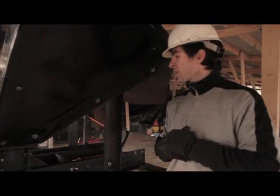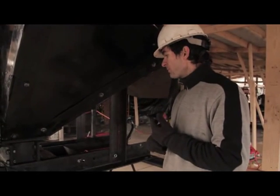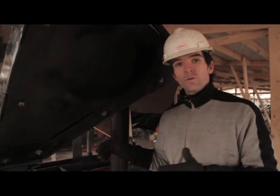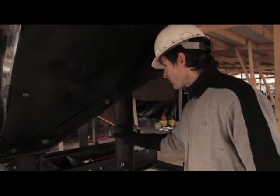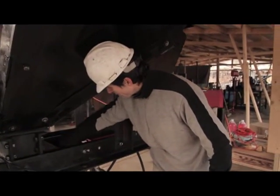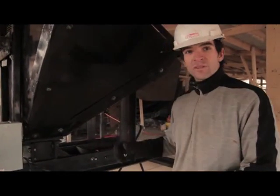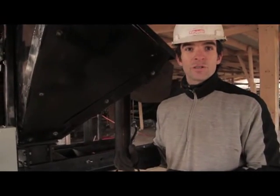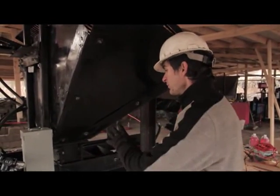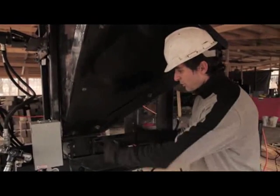How do you adjust the secondary cylinder upon startup of the machine? That needs to be done once. With the full code in operation, you look at how far the cylinder is moving and then adjust the position of each magnet so that when the drawer opens, it opens the chamber completely, and when it ejects the brick, it moves far enough that the hole in the drawer allows the soil to go in fully.